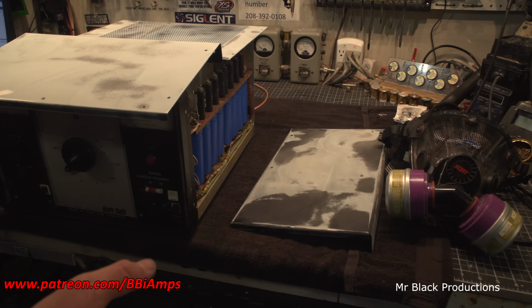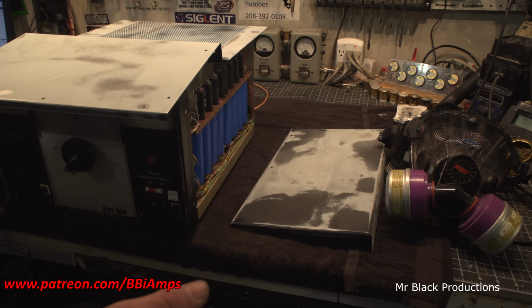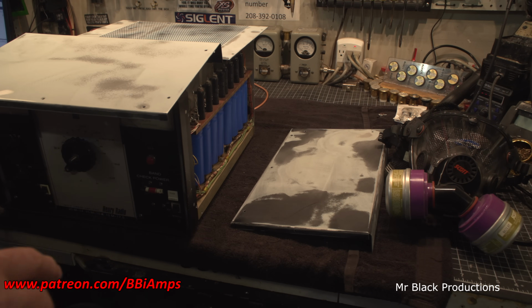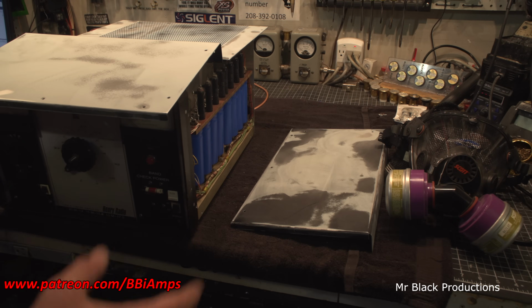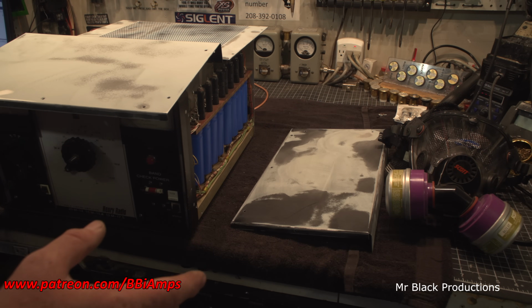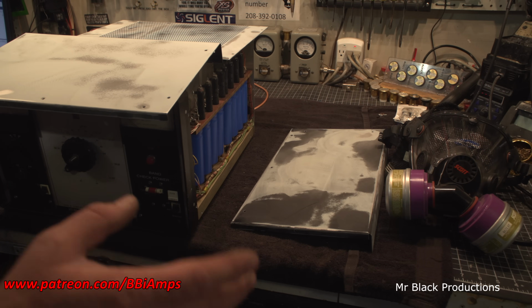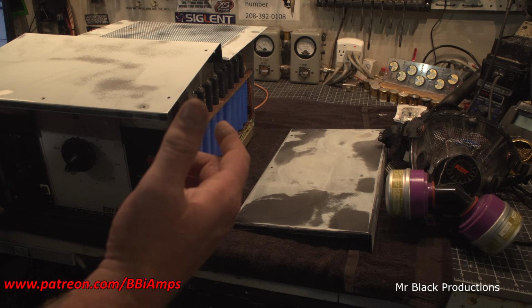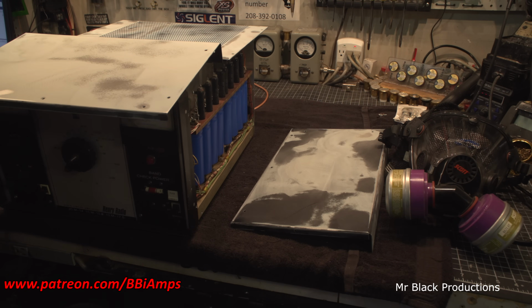So what we'll do now is we'll do our job diligently and correctly. That means we're going to get ourselves a clean cloth and put some denatured alcohol on it. We're going to wipe all this down with naphtha or denatured, let it dry, and then I'm going to come back and probably hit this with a green, kind of lime colored acid-based primer to really grip onto that aluminum as the substrate paint. Then we'll come back tomorrow after that gets a full night of drying and curing, and shoot this with 2-part epoxy gloss black, which means it's going to be as hard as the backside of most of y'all's heads, and harder to scuff off than regular old rattle can paint. So we'll make it look pretty.